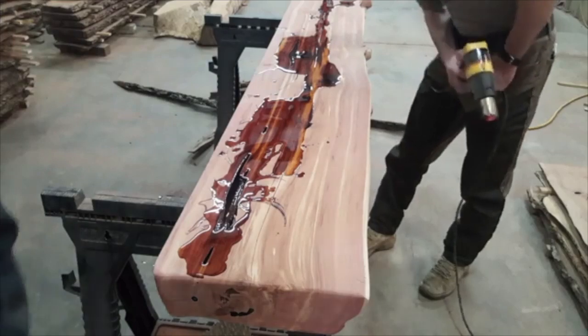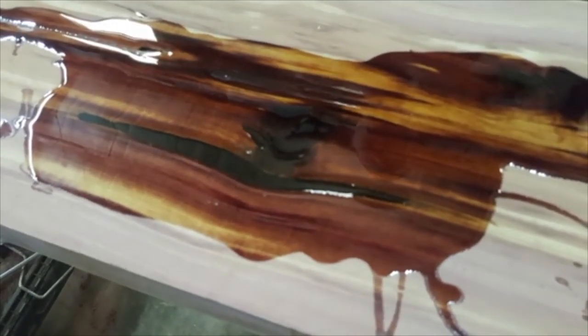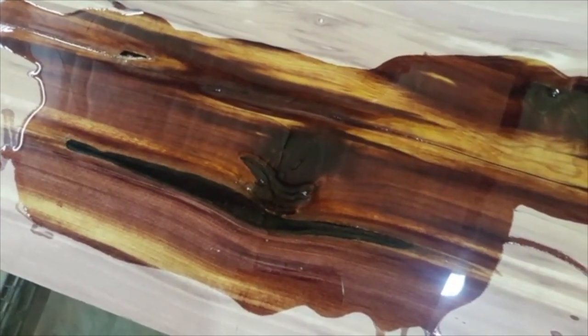Can we show that? You can see they're definitely coming up now. I'm just trying to make sure we don't scorch it. It's like bubbling - especially in soft areas. Anytime you get into soft areas of the wood, it's real porous, so it's a lot more air content than you would see in a really dense hardwood. So anytime you're doing void fills, you definitely want to watch it even longer. It's the best time to babysit it.